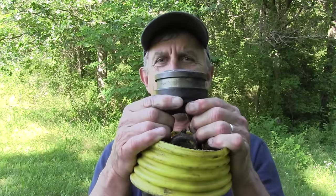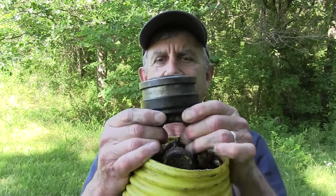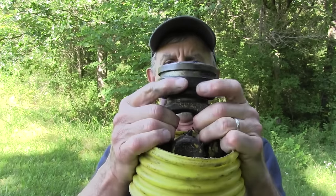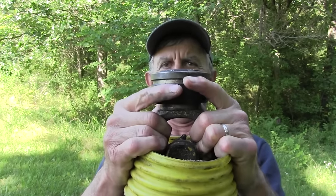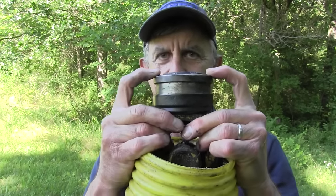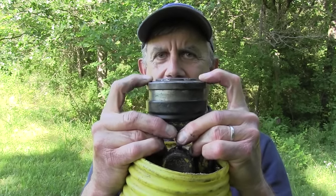But you've got to promise me — let the video run to the end, even if you're out trying to get your PTO shaft back on. So don't shut the video off after I show you this. But if you've got a PTO shaft like this, and there are thousands of them out there, and you're trying to get it on by pushing this collar up — that will not work. What you've been doing wrong is that you've got to pull this collar back to get the PTO on. You're welcome.